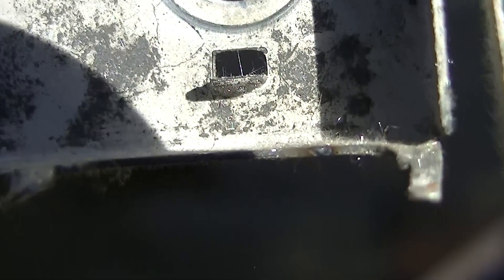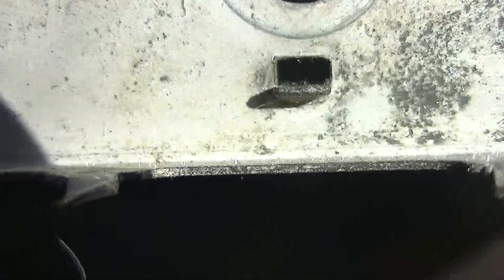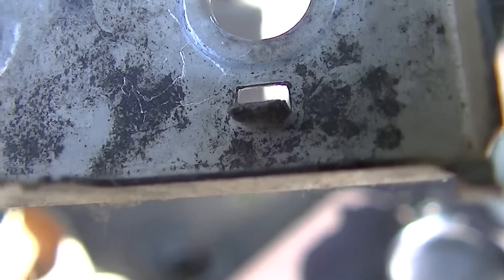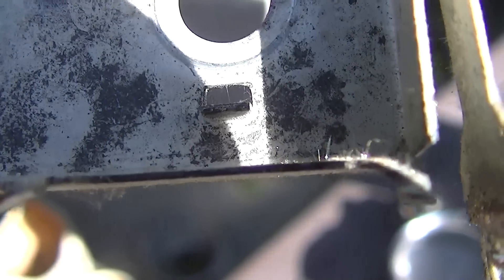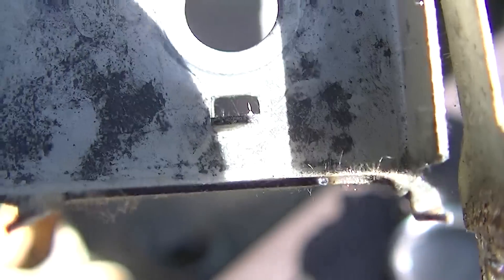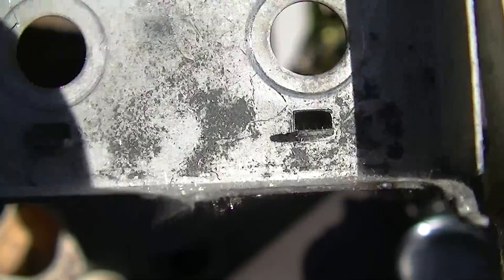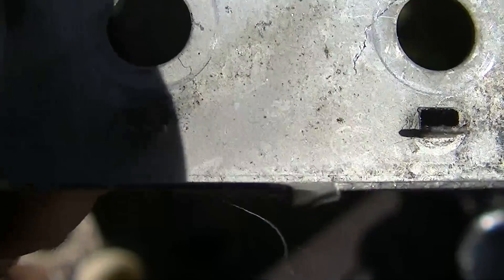They short out the vertical and AGC, and they cause the set's vertical to collapse. I mean, they're literally so fine. You can see them there on the right side of the unit sticking up. And there's one sticking off the right side, flapping — you can see it's shining. Make sure you're watching this video in 1080 if you can. They're all along in here, just millions of them.